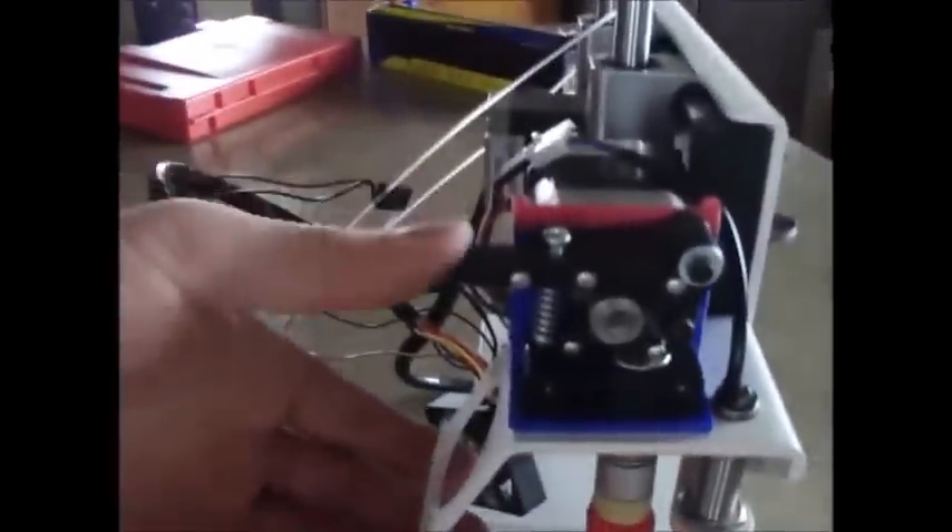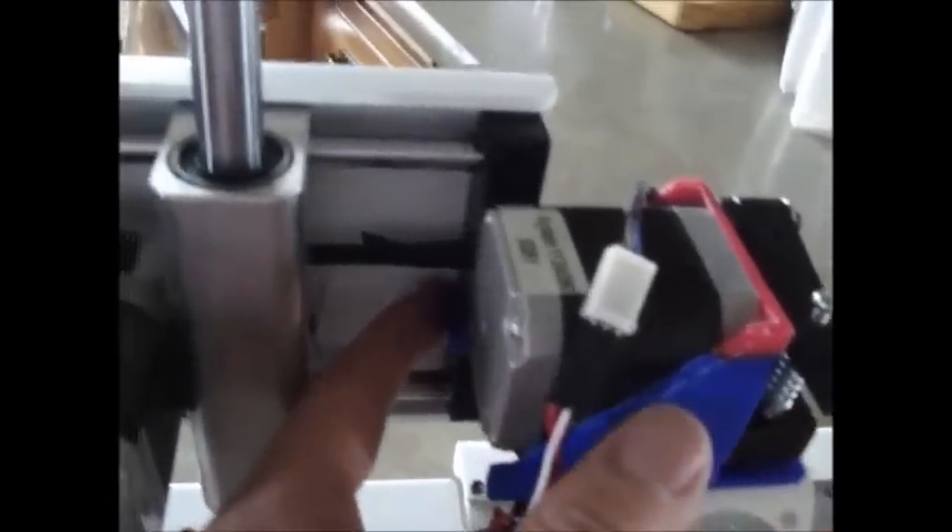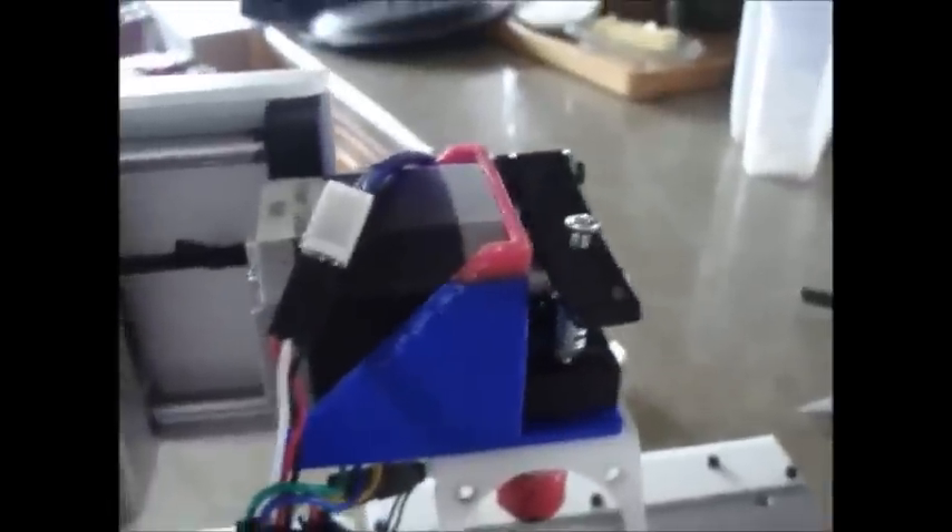There you have your PrinterBot extruder. You can see we have this little piece in the bracket attached on. You're going to lose maybe a little more than an eighth of an inch, but that's going to affect your Y end stop. This motor is now going too far back and hits off on the aluminum piece, so your end stop wasn't working. You have to make sure this bracket piece — whatever color you print it in — touches off on the back.